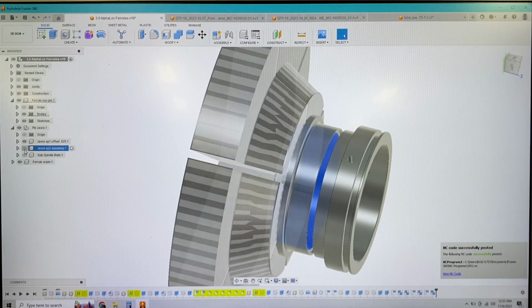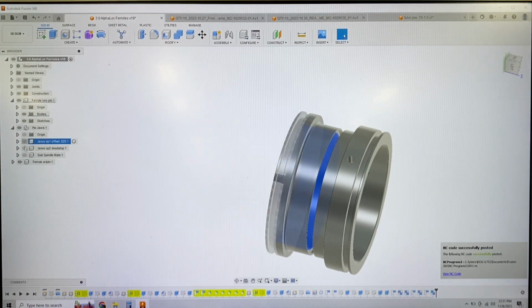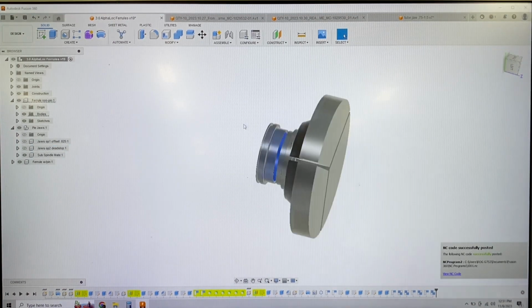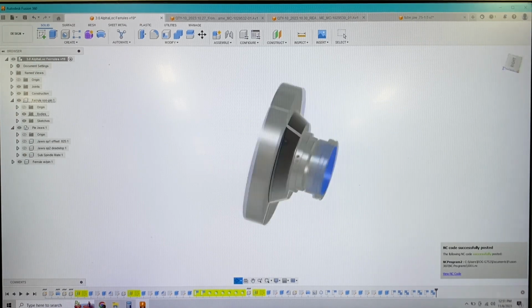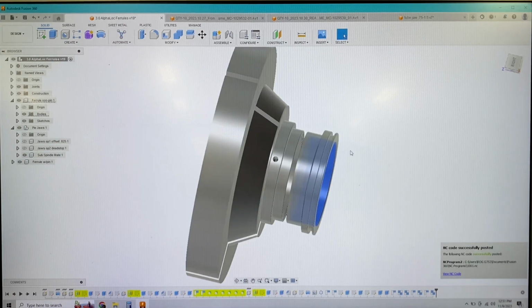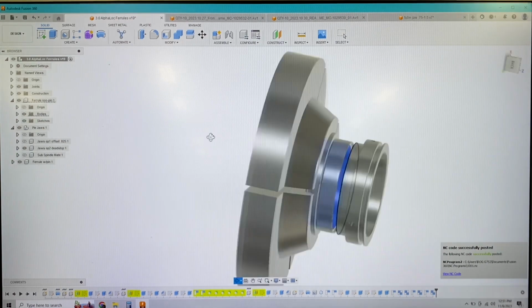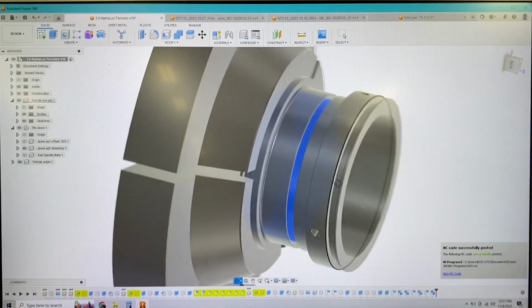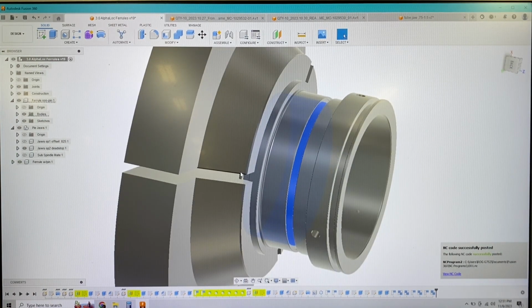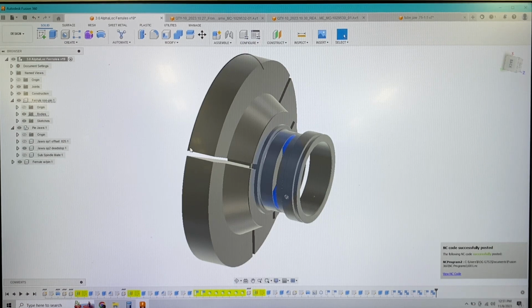From there, it's going to machine this front part of the ferrule. And then it's going to get transferred to the sub spindle, which is this side. And then it's going to machine this side of the ferrules in the sub spindle. And then it's going to transfer them back to the front spindle, but this one's going to be a dead stop. So basically this part will be even with the back of this jaw with no offset. So this will probably all make more sense later as we go through this, but that's the basics of the models that I need to manufacture these parts.